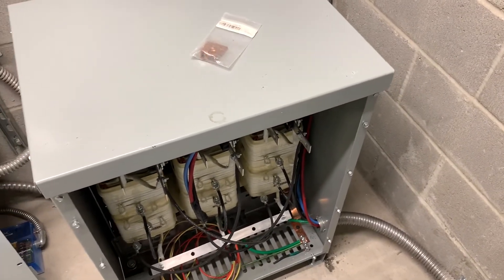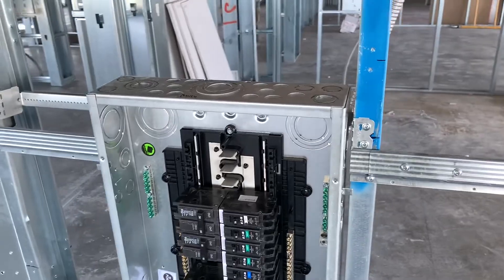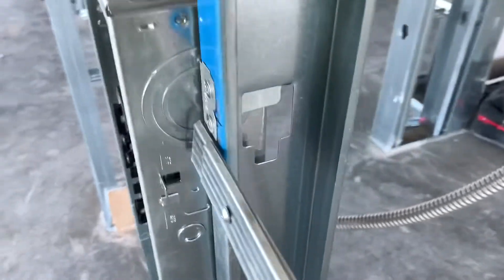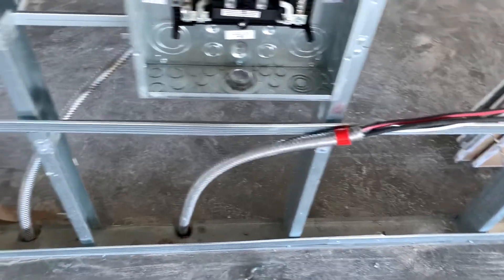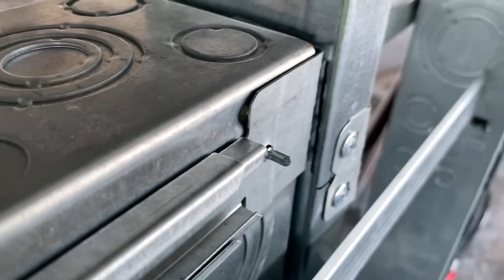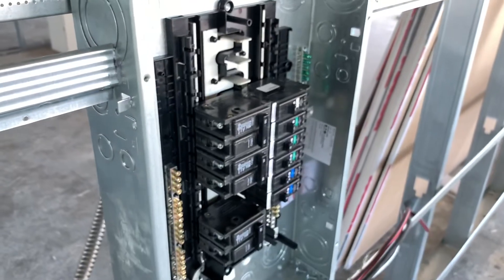Up here on the sixth floor, working on installing the feeder wires fed up the last couple days, but had to move the panels down because they were at the wrong height. There are two screws in the front and one on the back to hold it steady, with washers in the back for the right depth out of the wall. It was more complex than just unscrewing four screws and dragging it down four inches — had to take basically everything apart: panels down, spreader bars down, unscrewing the panels from the spreader bar and redoing everything. I was getting quite upset about it.